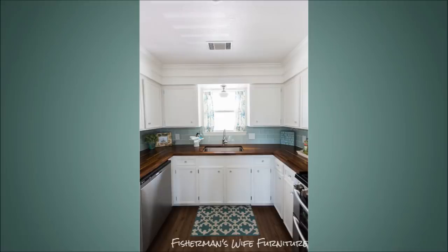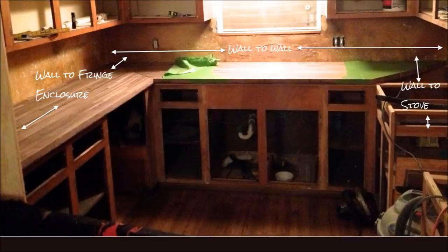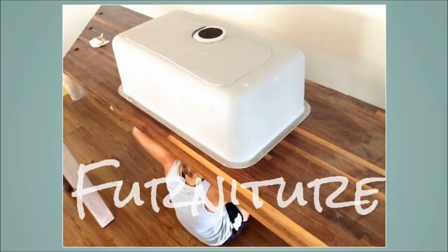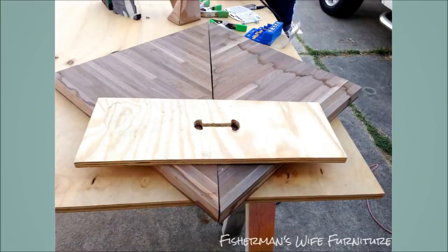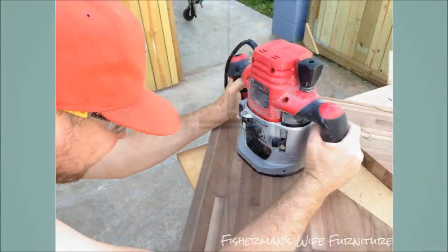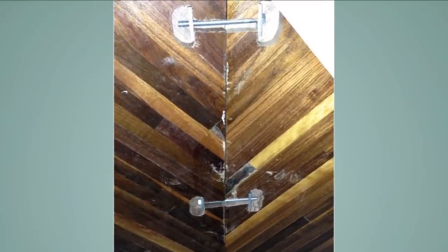Number 16, countertops for butchers. It's very easy to cut your budget for countertops, but you have to invest your time instead. Purchase a butcher's block from the store to fit your kitchen size. Then seal both the surface and bottom of the block with a sealer liquid to protect it from heat, scratches, and moisture. If you want to paint the block, do it and apply sealer too. Next, you have to cut the area for the sink and also join the corner. Lastly, install the corner in its place with a fastener.